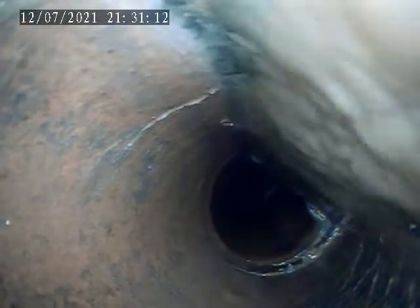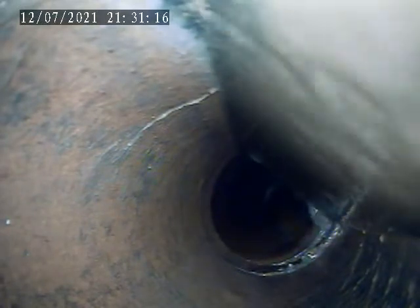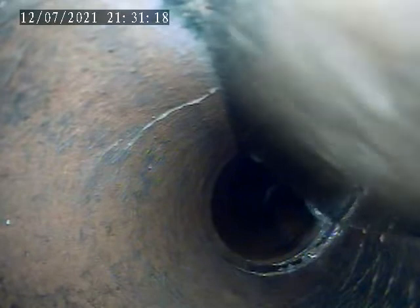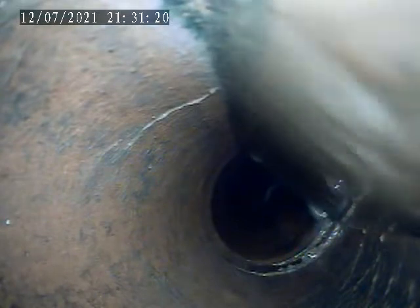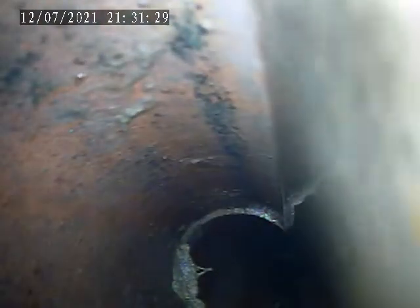There are a couple other little cracks — see this little crack here, and then down in here too. See how that water is coming into the pipe? It's leaving out of the pipe and coming back in, so there's a break there. So when it was clogged, the water still went up under the floor basically. That's why you weren't completely backed up.